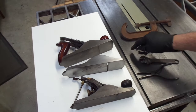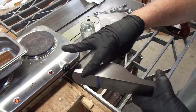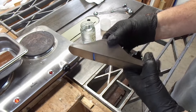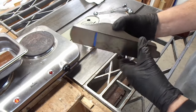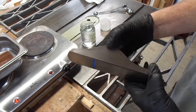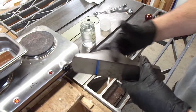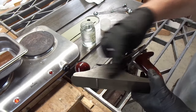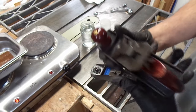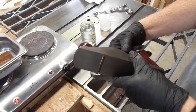I'd like to share how I do it on a plane without mucking up the Japaning. The color of this finish is very close to the color of my table saw. In the world of gunsmithing, the technique is to boil the piece in water. The combination of heat in an oxygen-free environment drives the oxygen out of the hematite and converts it to magnetite. On this plane I actually did boil the entire body — I was a little concerned it might hurt the Japaning, although I'm pleased to say it doesn't seem to have hurt the finish at all. But I still don't like that technique.